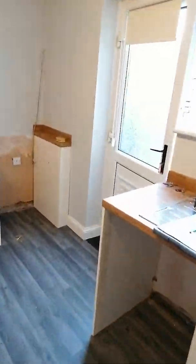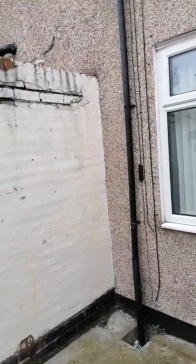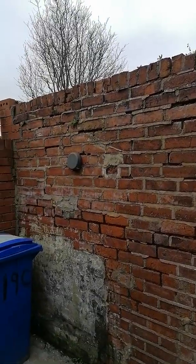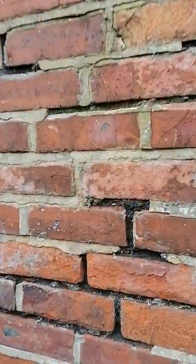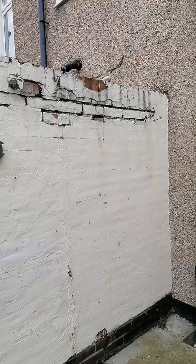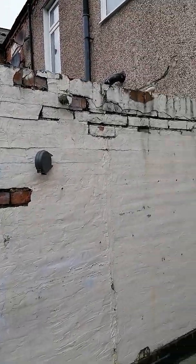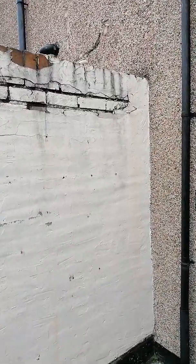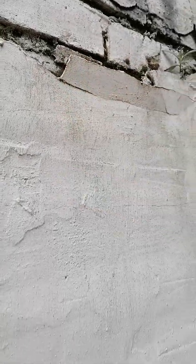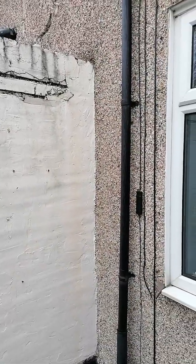So we come outside and what we've got is an abutting yard wall. You can see the condition of the wall — it obviously hasn't been very well maintained. There's your black ash mortar, very common especially around the pit villages. The brick-on-edge has a little bit of a render curtain. Rain water is getting in on the top of that brick-on-edge, getting behind this render, which is obviously not in great condition.